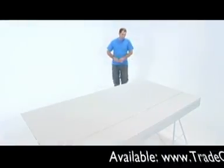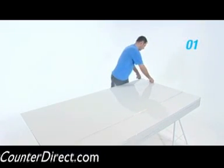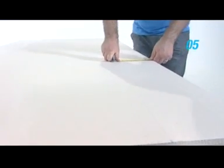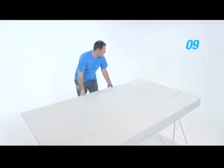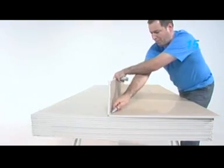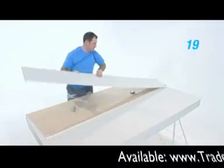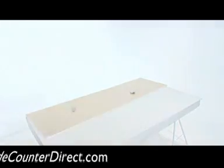The traditional way of cutting board is with a utility knife. Either the board is cut, then turned and snapped before the reverse side is cut, or the board is cut and snapped before the user then kneels to cut the reverse side. Either process exposes the user's fingers to a sharp blade and requires him to walk backwards, pulling the blade towards him. This can have health and safety implications on a construction site. In all, the process has taken 21 seconds to complete.